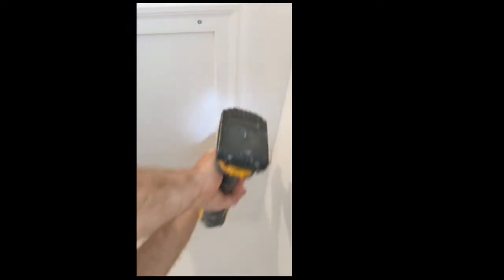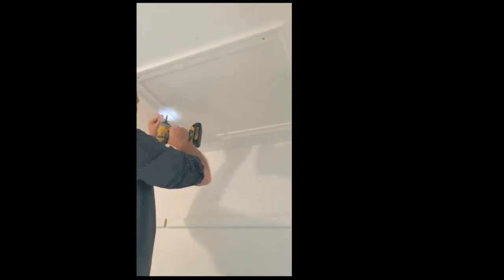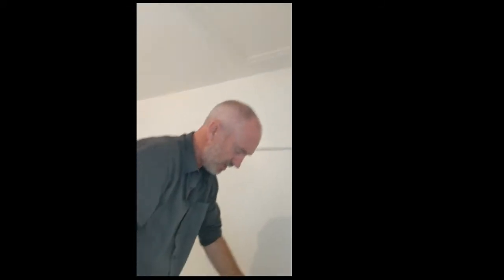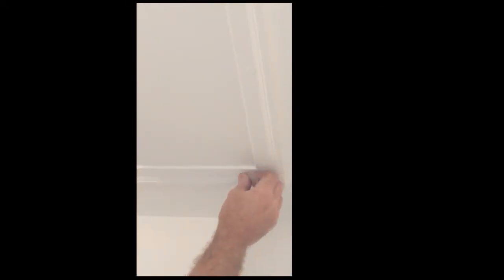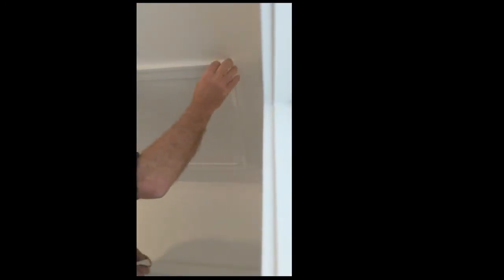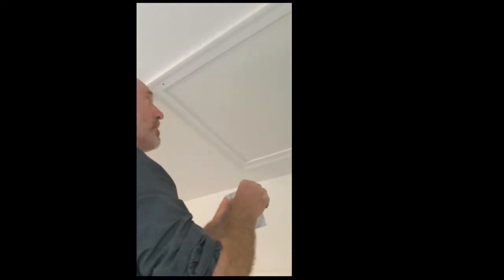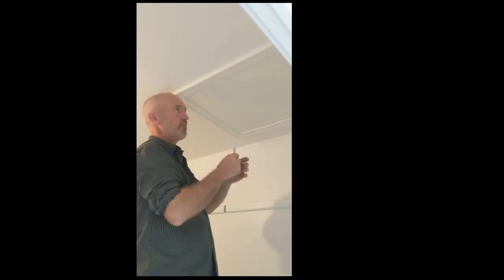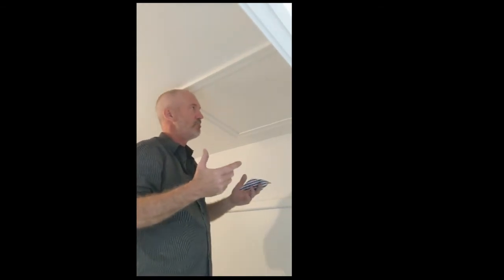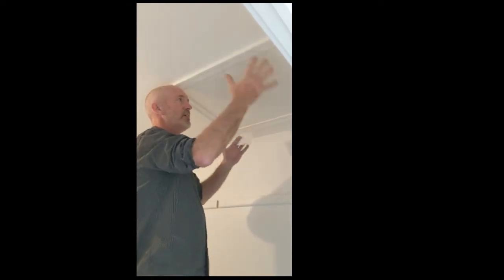Those are all pre-drilled. One thing left is to put the caps over top of the screws. The nice thing with this system is it's totally pre-finished — the whole thing can be installed in the morning, ready for a homeowner walk-through, and you don't have to worry about tracking a painter down. It just pops out — the cleats stay there — literally a minute and a half to remove everything, and you've got a full R40 and a nice pre-finished look.